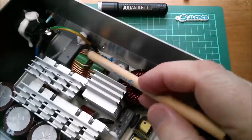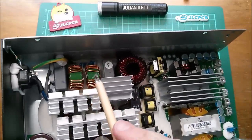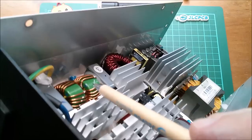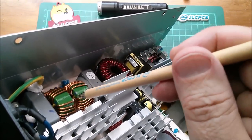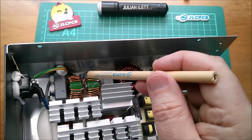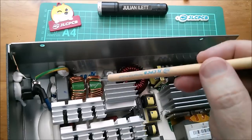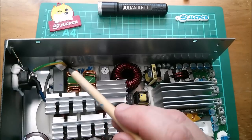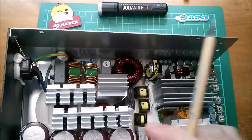These two look like common mode chokes — they appear to be wound in two halves, and down the middle of the toroid there's a little yellow separator, so I'm pretty sure these are common mode chokes. There are some little blue capacitors down here, two of them, almost certainly class Y — so they're strapped from live to earth and from neutral to earth. It's all EMI/EMC suppression filtering so that this thing doesn't emit vast amounts of noise.